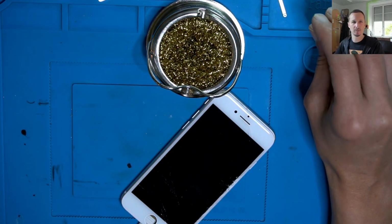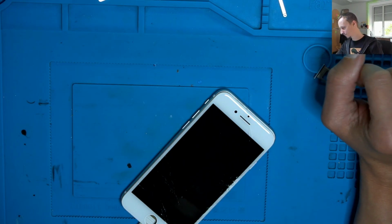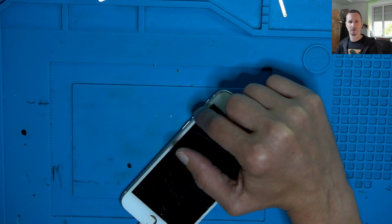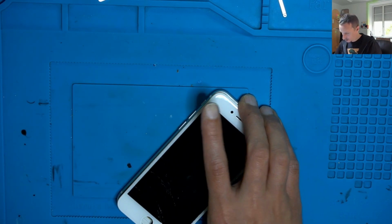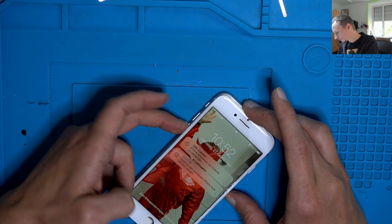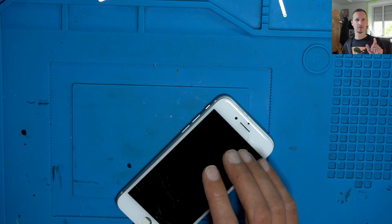Okay, that's how simple it can get. We got almost tricked by DFU mode because the power button has an issue and is constantly pressed, so it puts you directly into DFU mode. Normally it takes another volume button to get into DFU mode. Don't ask me, maybe we have some issues with that too. Oh, cannot. Come on. Well, I can test the home button. It doesn't matter. Yeah, all buttons seem to have some issues, so that's the end of the video. We're going to get the data.